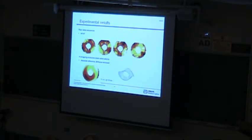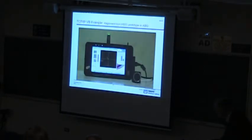And because the whole secondary had been positioned off axis and then tilted to compensate, we were able to just bring that right back in. And so we took that telescope from initially being about 3.6 waves peak to valley to about 1/3 of a wave peak to valley afterwards. I put that up there because it was a great example of how, if you have a real-time phase available, you can use it to dial in your optical system.